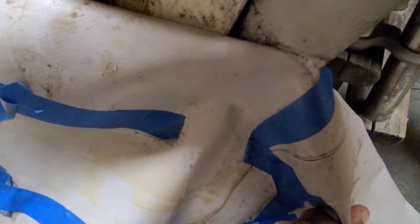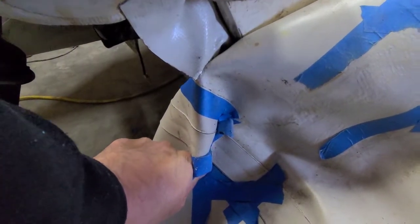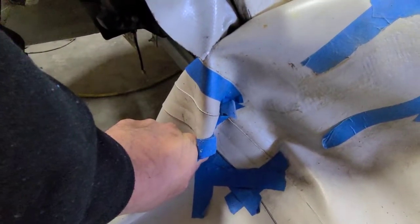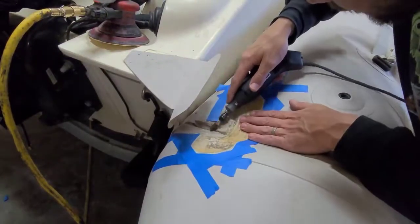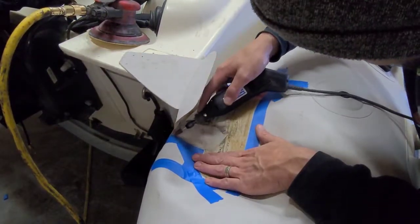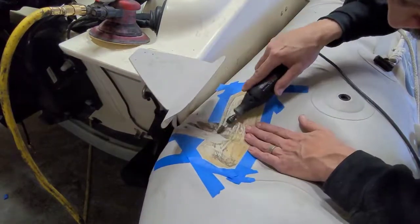Pull down on the tubes with a little bit of tension and get it to right where you get to the strongest part of the glue that's already on the boat. This will allow you to take care of any weak glue that may be present. Let's start by cleaning the surfaces and getting rid of all the old glue, dirt, grease, and oils that are in there.